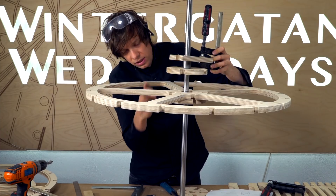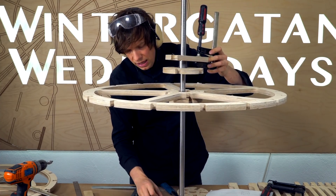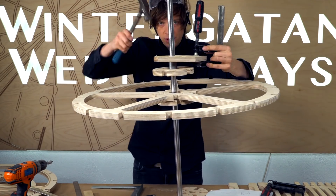I'm having a spacer here in between, so all the force I'm putting on the bearing right now is only on the inside ring. Otherwise you can destroy the bearing if you put the force at an angle or something.